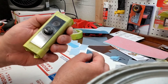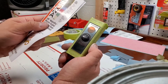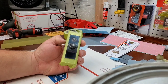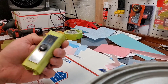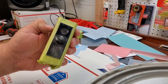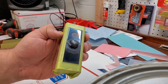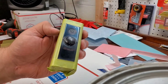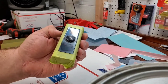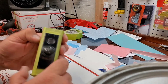Realistically I could probably stop right now and it would be great — it's really impressive just how clear that is. But I'm going to move on. The next one is 8,000 grit, the pink. After sanding with the 8,000 grit pink, I can't believe how clear this thing is getting. There are still some slight scratches, but I still have two more grits to go. The bottom doesn't look the best, but I just want the camera to be able to see again.